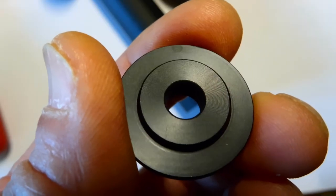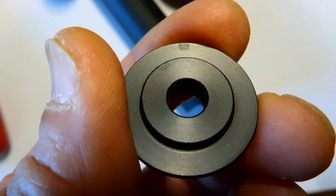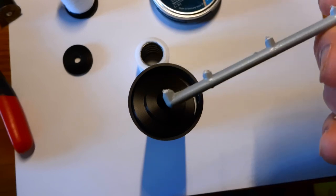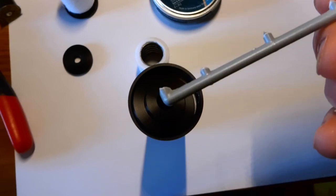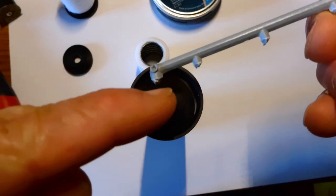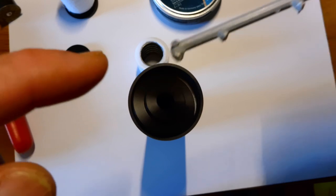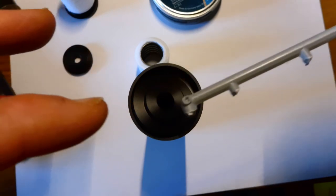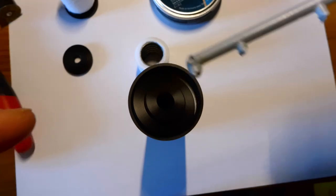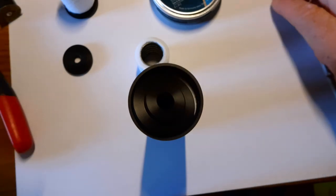The orifice plate must be designed precisely. Now, in order to remove the orifice plate, I've used a piece of polystyrene — some soft plastic — basically it's got an edge on it here so I can hook it and pull it out. You do not want to damage the surface whatsoever, the internal surface or any of the surfaces of the orifice plate.